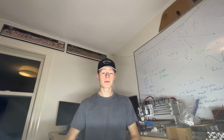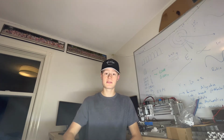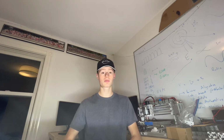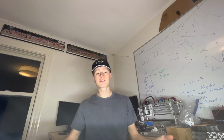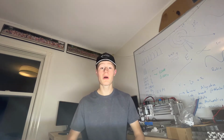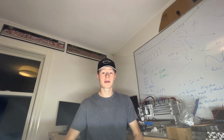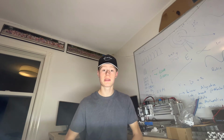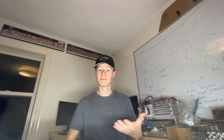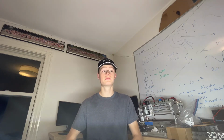After we've implemented our stepper motors, we only need a few other things. First off, a drilling motor to actually drill out the areas of the PCB, a computer to actually control each of these motors. In this case, I'll be using an Arduino, which I bought off of Amazon for $10. For people who haven't used Arduinos in the past, this is an Arduino. Then, I'll need a power supply to convert 120 volts from the wall into the 24 volts I need to supply to all the different components that we'll be using to power this. And then most importantly, zip ties.